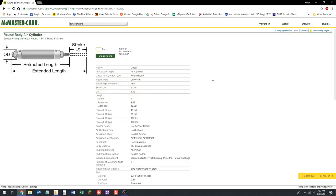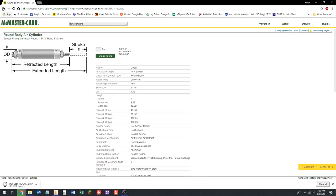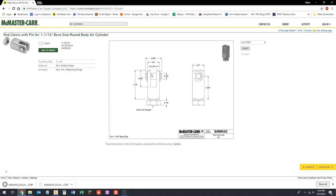We're going to download this and get a STEP file. While that's downloading, we're also going to need this — a rod clevis with pin. A lot of teams use swiveling rod ends, but we've used that maybe once on Stellar Robotics. I just find they take up an annoyingly large amount of room, and in a lot of cases the clevises are able to handle enough misalignment that you don't need the swiveling nature of that. So we're going to download a CAD file of this as well.